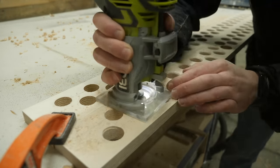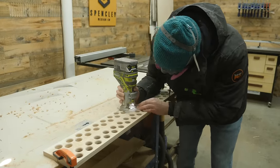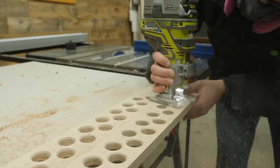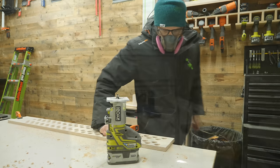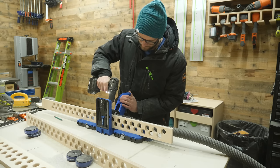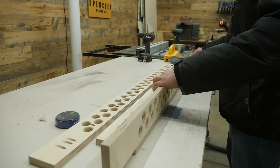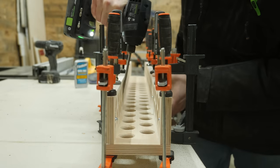I know what you're thinking — Ryobi tools are total garbage. Honestly I couldn't disagree more. Sure they are entry-level tools, but they are more than capable of building just about anything. Are there higher quality tools out there? Of course, but I've used and abused this one for almost three years and for the 50 bucks I paid for it, that's a heck of a value. Let me know your thoughts about Ryobi tools down below. To attach the pieces of the main arm together I'm going to use pocket holes. This new 720 Pro jig from Kreg makes the process super easy and has built-in dust collection. I'll put down a little glue between all the pieces and secure everything with the pocket hole screws — and make sure to clamp the pieces together so the screws don't accidentally shift them as you drive them in.